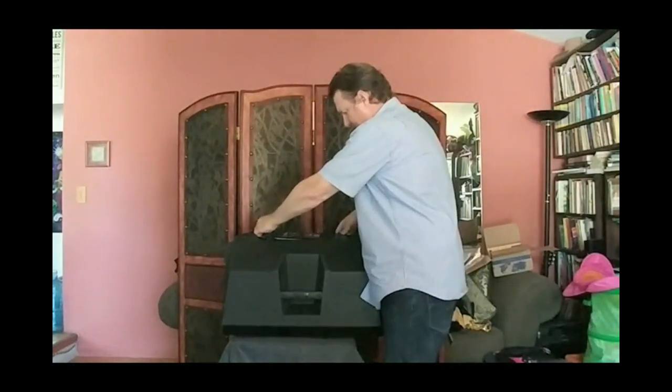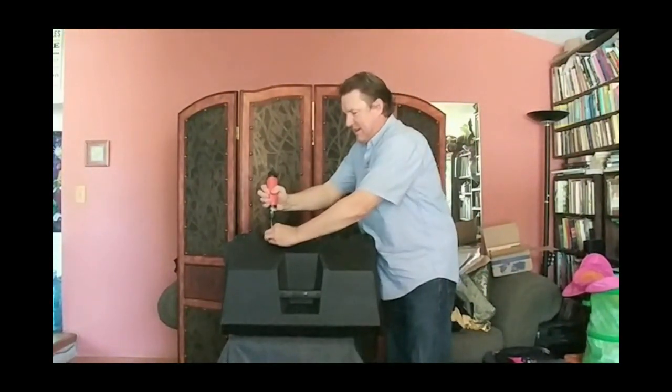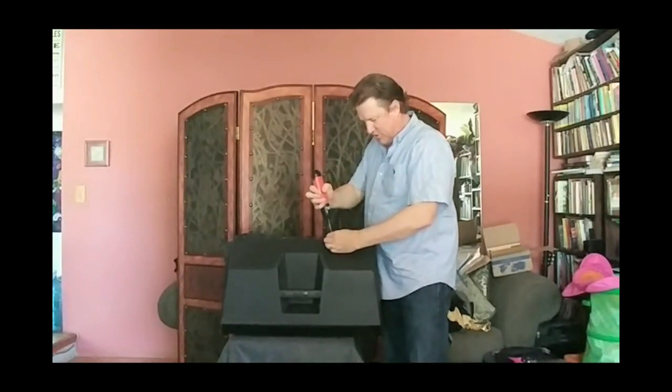We just put the top back panel back on, put our 12 screws back in, and this speaker is ready to test. The way you know the tweeter went out is suddenly there are no more highs — your speakers sound muffled, they just don't sound as good. These speakers have a gorgeous sound, which was the reason I bought them. But suddenly in the middle of a dance it sounds like they're singing into a wash rack — all the bass is there but none of the highs, none of the cymbals. You know you've blown your high-frequency driver, the tweeter horn driver.